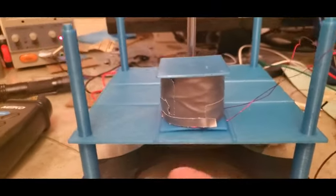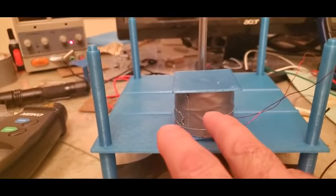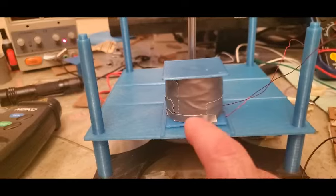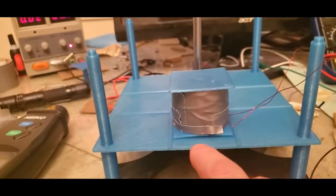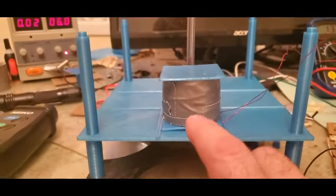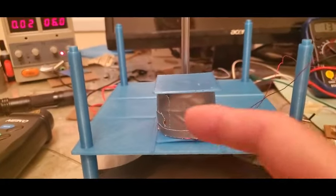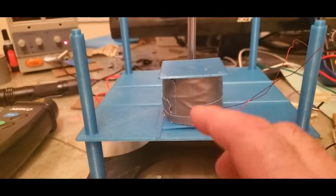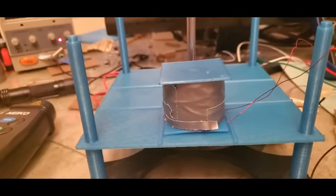But you can see it, and I demonstrated this a lot with the air gap, where if you move the coil up here, instead of that thing spinning at 790, it'll be spinning at like 1,000. Eventually you move it too far away, it won't interact. But the spin loss begins to get to a point where the rotor is even slowing down. However, the amp draw goes down as the rotor slows down, which is curious too. As I was saying, so that's all very curious. But what's going on? So let's let this thing fully spin up.